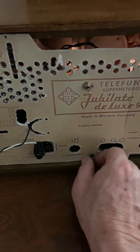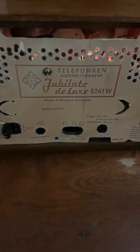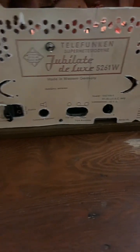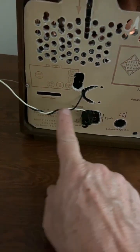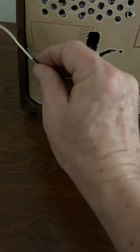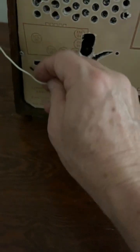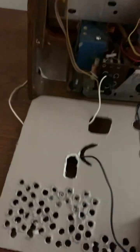In fact, this came to me completely dead, and I redid the bridge rectifier, electrolytics, and so forth. Notice that I have a wire that's just loosely coupling to the antenna. I'm going to uncouple that for the moment, and I'm going to pull the chassis down so we can see the circuit.